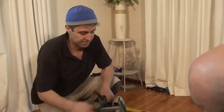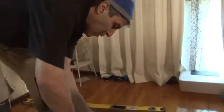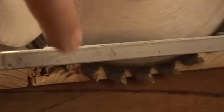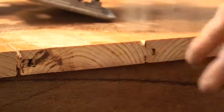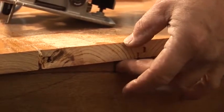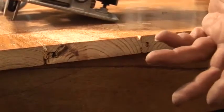What I do — the power saw is not plugged in, obviously. I set it where the hole is and I lower it and feel where the bottom of the floor is. So you're only cutting the top timber, not the bottom timber. That's right. If I cut through the bottom timber, I've got problems. Now obviously if I cut 5 or 10mm that's fine, but once I exceed one third the thickness of that timber, it's going to weaken the structure.